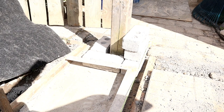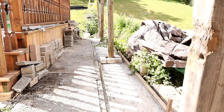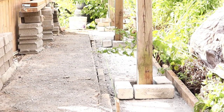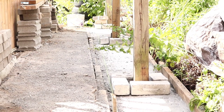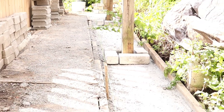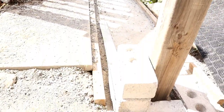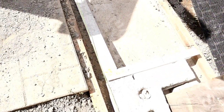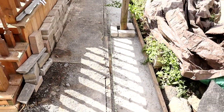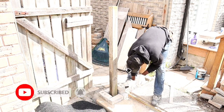So here's what I'm doing. I ran a line all the way down to the last column at the back. I have four columns, so I just dry-laid them — I put four bricks along the column and put a string line at the end. I put one right here, and then I squared it up — I put the square right here and lined it up so all of the columns are in line. I'm going to put it right on top of the column.